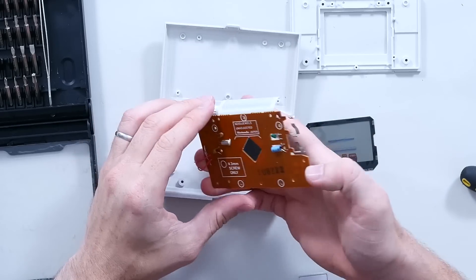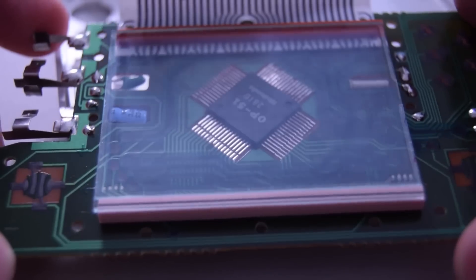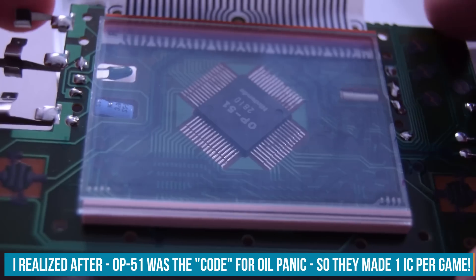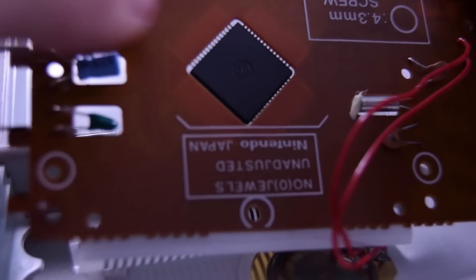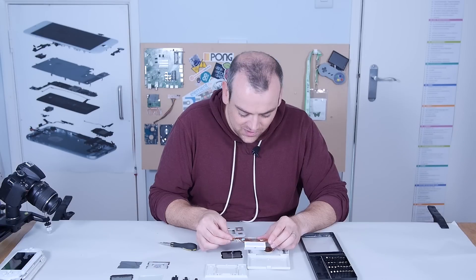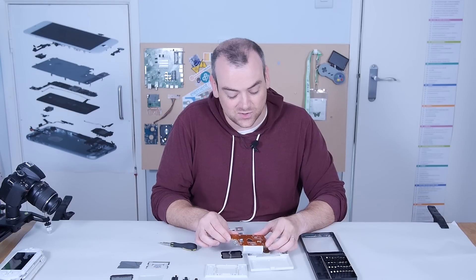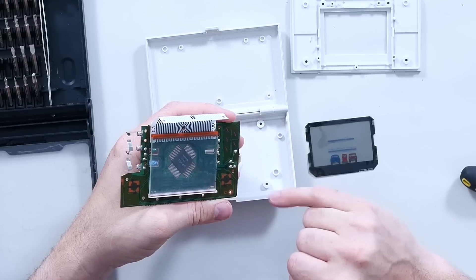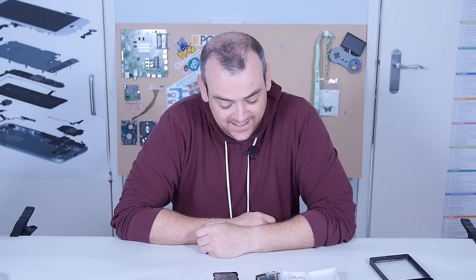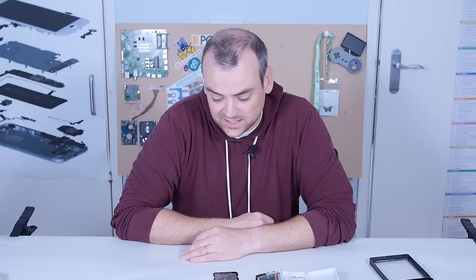There are a few passives on the board — I think that's a crystal, a couple of resistors, and a capacitor. But almost all of it is integrated onto this single chip, the OP51281D branded Nintendo. It's actually suspended midway through the board — I think they've mounted it that way to win back the thickness of the board, because this is a single layer, single sided PCB with etching on one side only. So there we have the finest 1982 had to offer: a single PCB, single integrated circuit, single layer, single side — a very clever manipulation of LCDs.